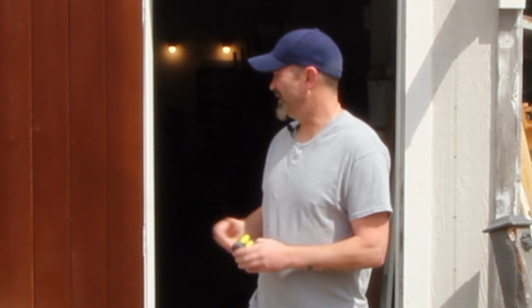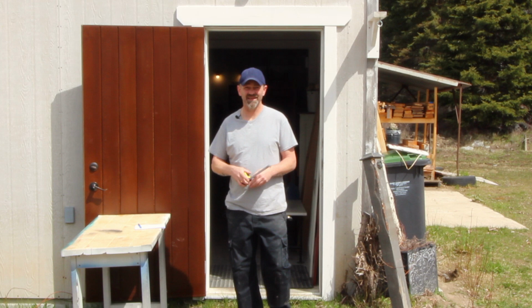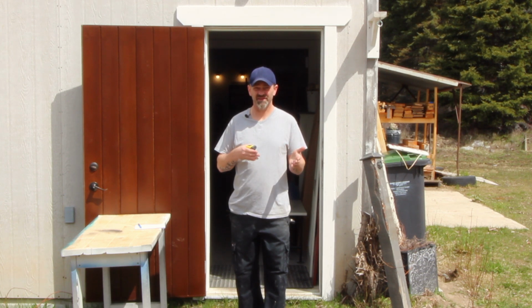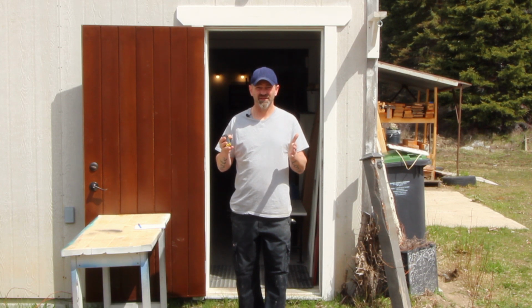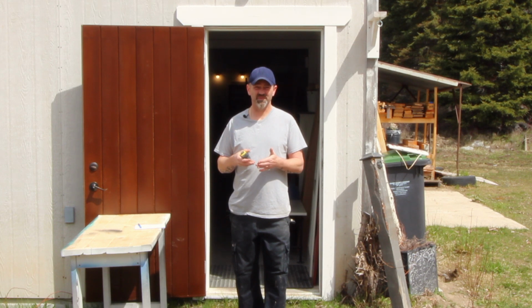Once you know that, then you know if you need extra space on the inside of your door frame for hardware, because depending on how it's mounted, how it sits, and how much area there is, you need a bit of spacing in there. So typically what I tell people is, if you have your measurement, and let's say it's 36 inches width-wise, then you want to subtract a little bit to compensate for your hardware and clearance. Normally it's about 1/4 inch to 3/8 of an inch on the overall dimension. So for a very tight door, that'll leave you 1/8 of an inch on each side, for example, by subtracting 1/4 inch from that width.